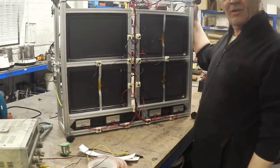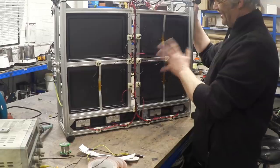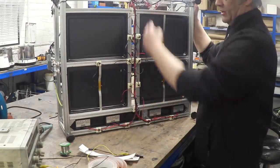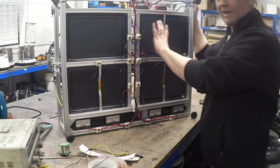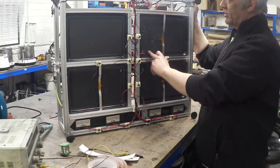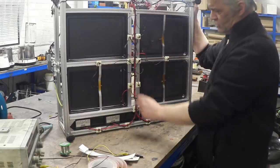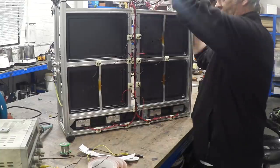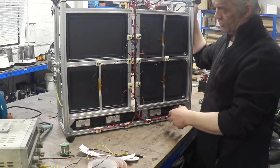Here it is, tipped on its side showing the underside of the machine. These ones have been done, and what I like about them is you can't actually see anything. This is just the wiring loom and everything's been wired in. The circuit is really quite simple — it's just four of them. Your negative goes straight to the negative. Your positive comes down to the switch in the temperature controller, then back out and to your positive supply. So you're switching the live wire.